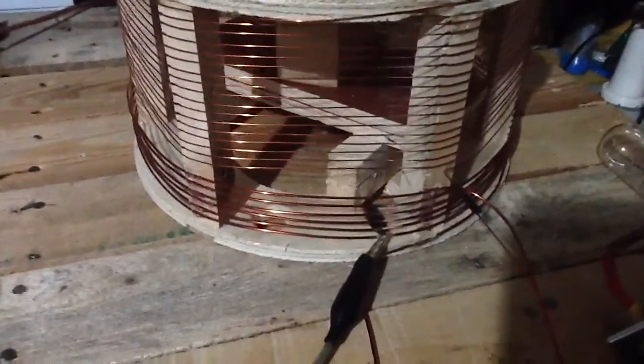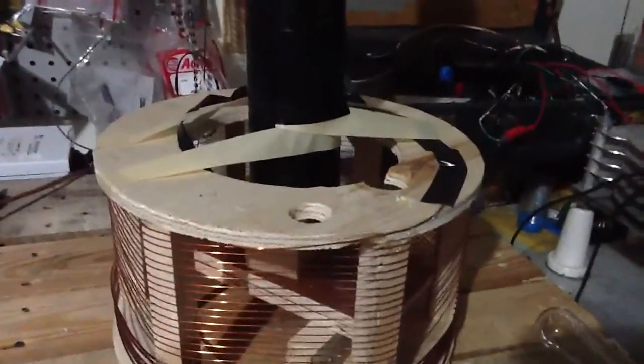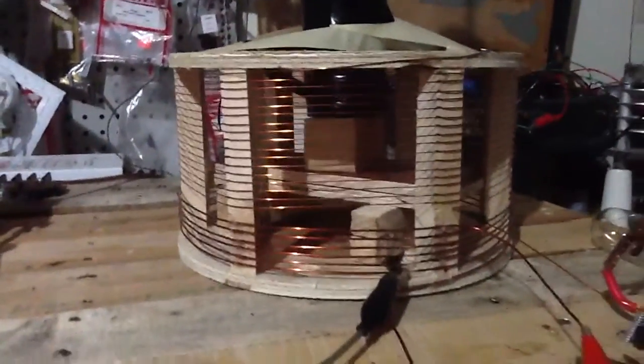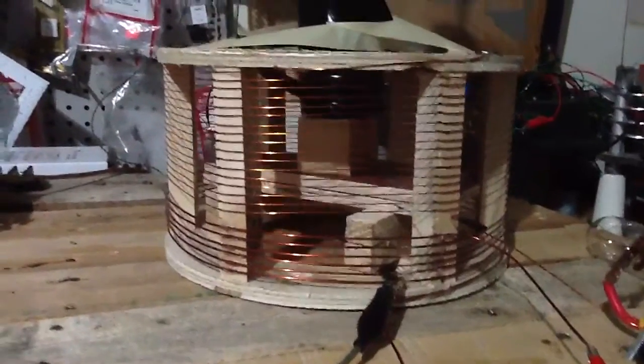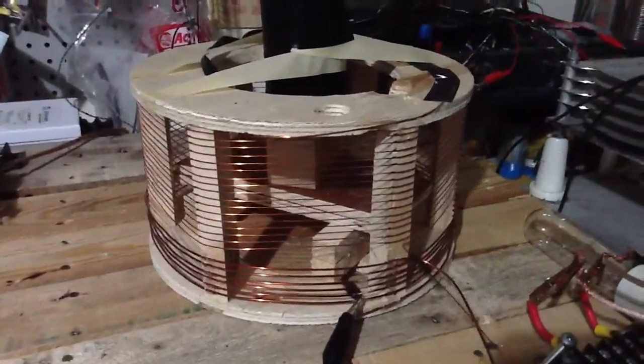And the primary smacks that ring, and then that goes up the secondary, which is coupled straight to the base of the extra coil resonator. Tesla suggests to put it slightly below the top turn of the secondary, so it's kind of a dual quarter-wave resonance.